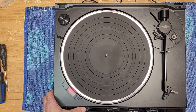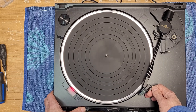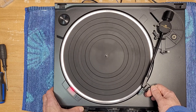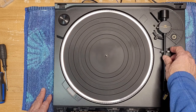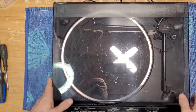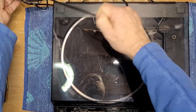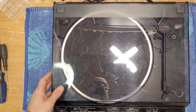Having a look at the speed pot over here — it looks like it needs a little bit of cleaning because when I move it to the right it's getting a little bit of a jump, but it's not horrible. We'll give that a cleaning. The dust cover is in pretty decent shape — usual scratches. I'll unplug it. This is one of those turntables that does not have a ground connection — it's internally grounded, so you don't need a ground lug on your amplifier for this one.